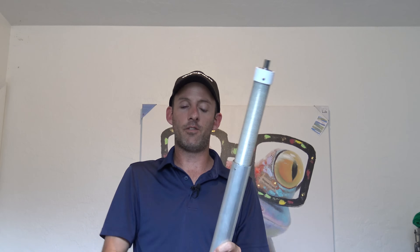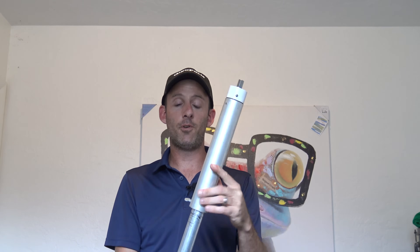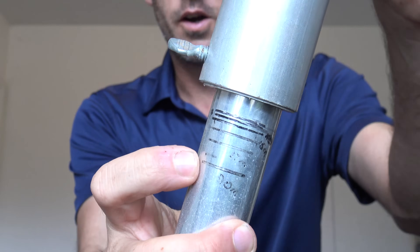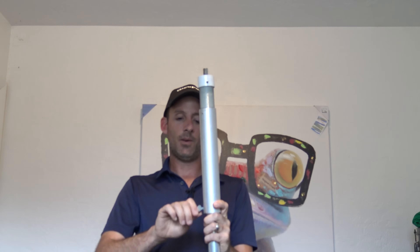For 6 meters, being only about 5 or 6 feet, you'd put that to the top roughly. There's some tuning involved. When I had this on the car originally, I had it marked. I used a marker and would sit out there with the antenna analyzer, put the antenna on the roof, and adjust it.